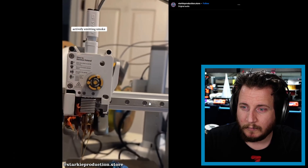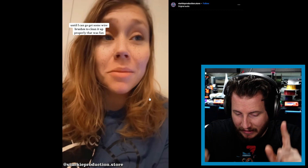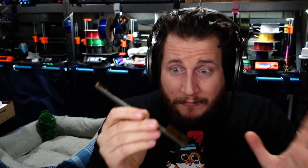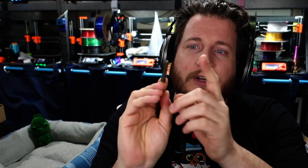That printer is out of order until you can get some wire brushes to clean it up. We recommend firearm cleaning brushes — they're really nice because one side has a softer metal with longer bristles, and another side has stiffer bristles. They're relatively cheap; we'll link to some in the description. Because the handle is normally nylon, they're good for high-temp applications. Be careful — it is metal, so you can short out connections. If unsure, power down, clean while cooling, then warm back up and repeat.